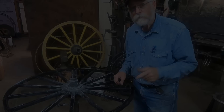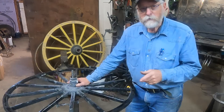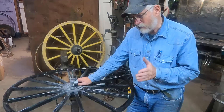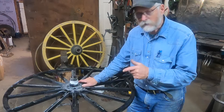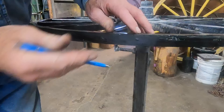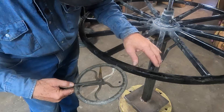When I went through the process of doing the pros and cons of fiberglass wheels, there were quite a number of comments that Diane relayed to me — questions about how do you set the channel, doesn't the hot channel bother this fiberglass, does it burn it or melt it? So I thought I'd go through the process of just what it takes to put channel iron onto these fiberglass wheels. Since there's no joint in this fiberglass wheel and the fellies, I'll start out putting a mark where I can start my traveler and measure the circumference. This painted leg is my zero — every revolution is 24 inches.